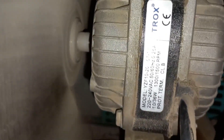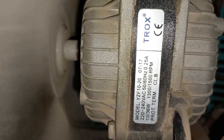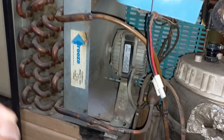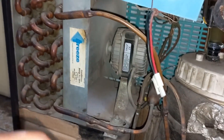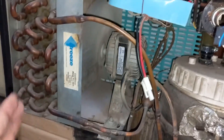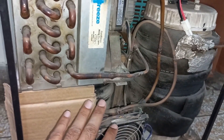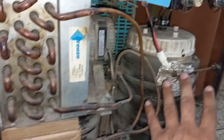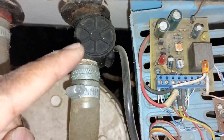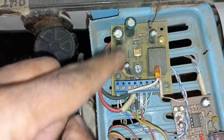Here we can see the data of this condenser fan I have used — current is 0.25 ampere and wattage is 36. I could connect a 52 or 50 watt fan with 0.3 ampere current, which would be better. But it has been working from last 2 years. After this air flow analysis, I will not change the compressor setting — the compressor will remain there as it is. I will only change the evaporator box. You can get information from there. If anyone has any question, they can ask me in the comments and I will reply. Thanks for watching. Take care. Bye-bye.